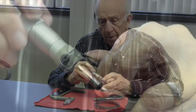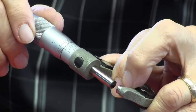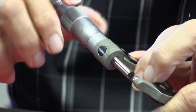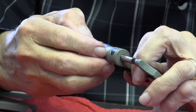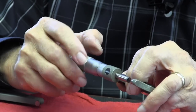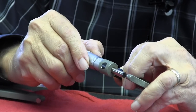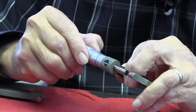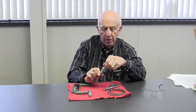Glenn, can you get a close-up of this? There are lines here amounting to ten lines, and if you were to divide this one-thousandth and move it over, each one of these lines — if you lined it up with the second one that would be two tenths, the third one would be three tenths, and so forth. So going back to the anatomy of it, there's also a slip clutch here.